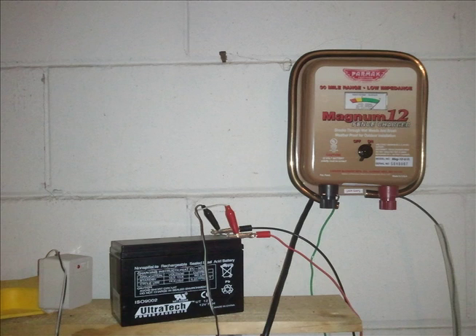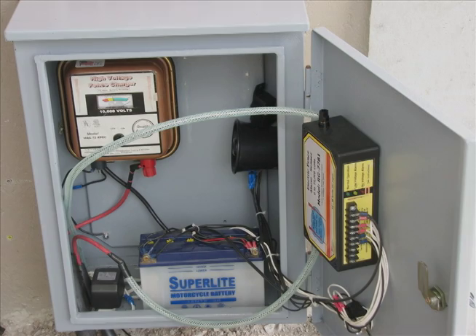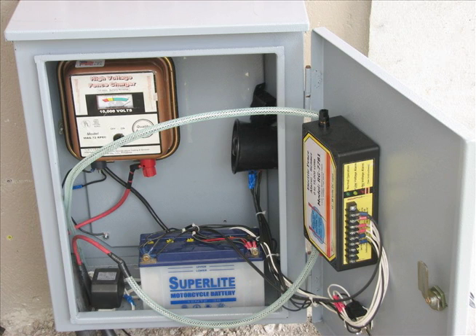In the first photo we see the most basic of setups: a 9,500-volt fence energizer running off a small battery, with the battery connected to a smart charger. We recommend 12-volt energizers versus 110 or 220 because in a power failure that small battery will run the system for up to three days — yep, three days. Use a larger battery and you can power the system this way for a month. With a plug-in system, your defense goes down when the power goes out.